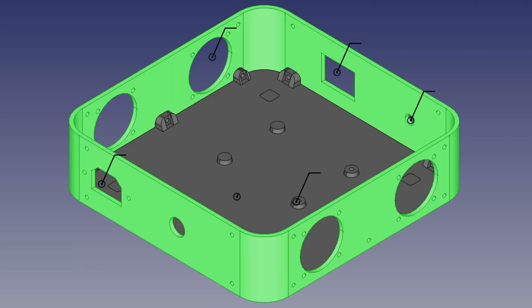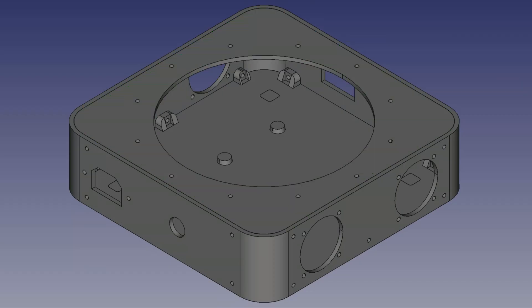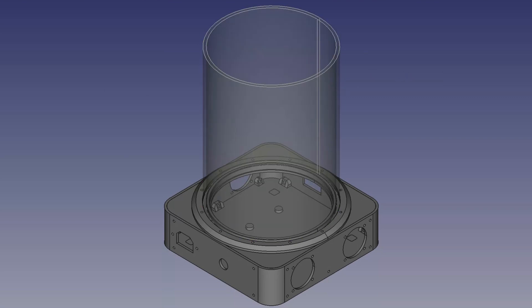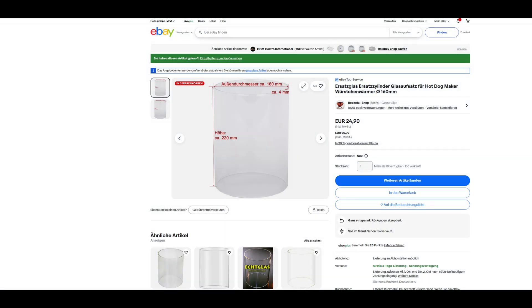Here I've got a 3D model that shows all the parts in detail. One very important thing is to use real glass. At first I thought about using acrylic, but it turns out acrylic is extremely sensitive to acetone vapors. It can crack, turn cloudy or even completely fall apart after just a short time of exposure. Real glass on the other hand is not only much more resistant, it's usually even cheaper and easier to get in the right size. I got this glass cylinder from eBay as a hotdog maker glass replacement for just 20€.